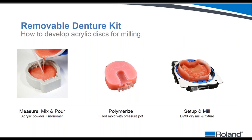We do recognize a need for other silicone mold heights — a 20mm or a 30mm option — and those are currently being looked into. We don't have them available today, but if you have a larger arch or higher vault needing the 30mm, or a lower denture that could use a 20mm to save material, those options are on the way. Once you pour and polymerize your puck, you place it into the material adapter and you're ready to load it into the machine and start milling.